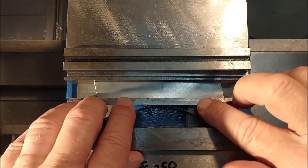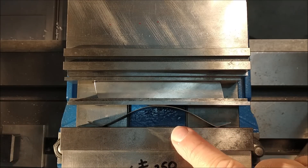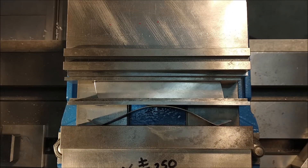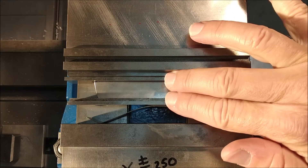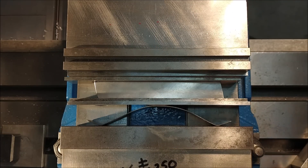Why is this any different? Well, aside from it being closer together, when the movable jaw moves, that parallel does not move. So spring placement might come into play with your setup - maybe not. This is also a handy setup if you have a part with an elbow or a lip on it. You can still register where you want to register and have space for that other feature to go down in there.